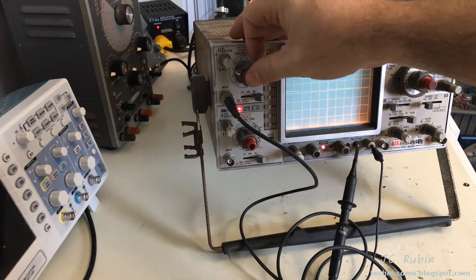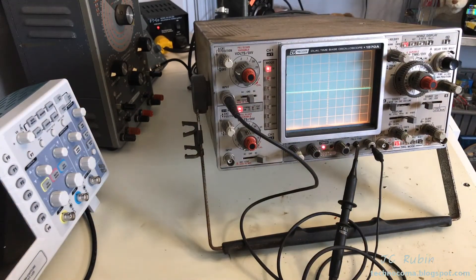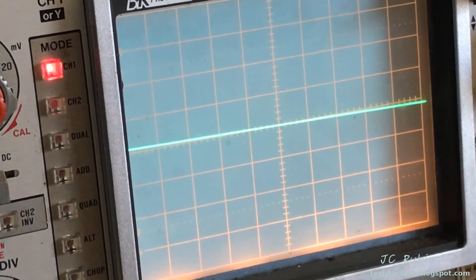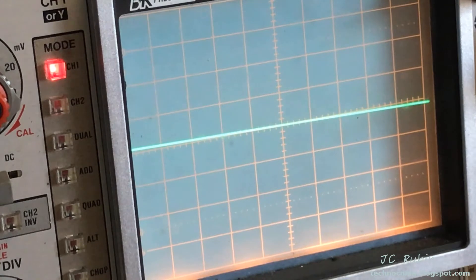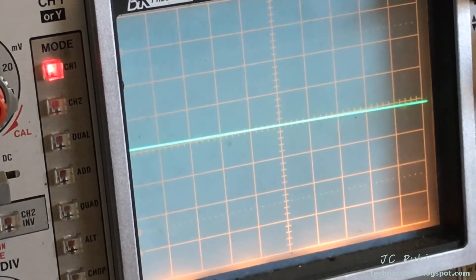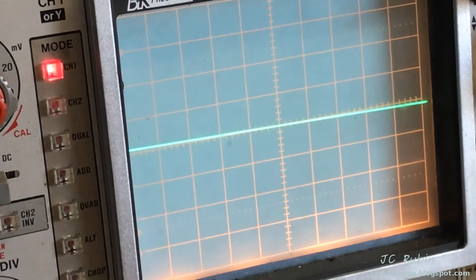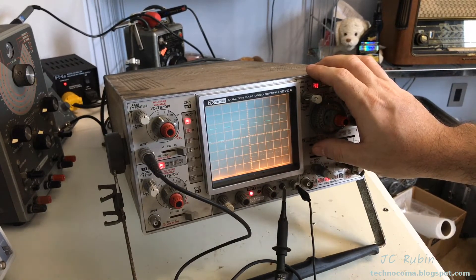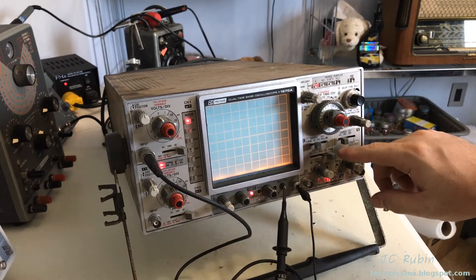Pulling it out is the five-times gain, and that one's also dirty. Another issue: if I flip it over to force to ground we see the next problem — the line is not straight; it goes from top left to bottom right. The trace is not horizontal across the whole scope, and obviously that's no good either. Also, the triggering connection is dirty so it's hard to get the triggering to stay stable, as you can see here. A lot of challenges going on.